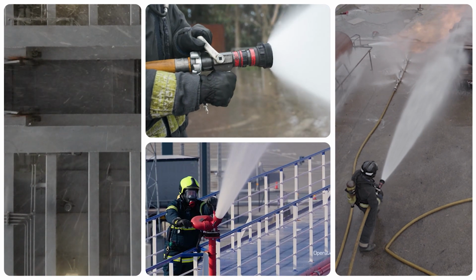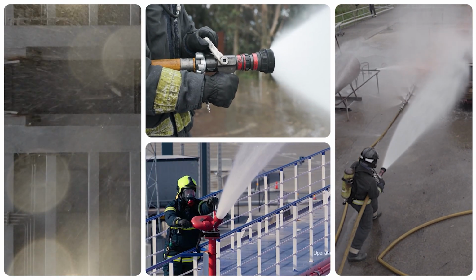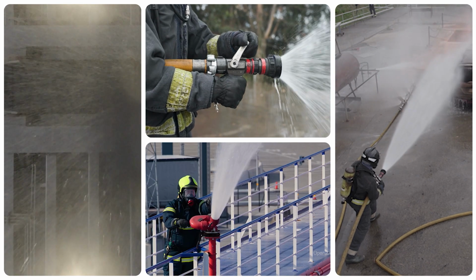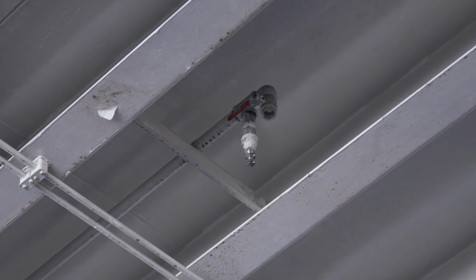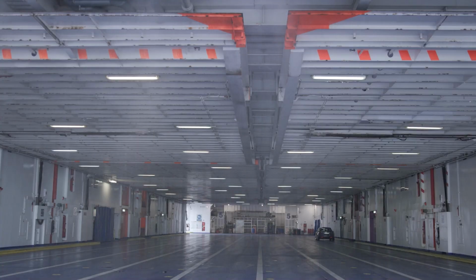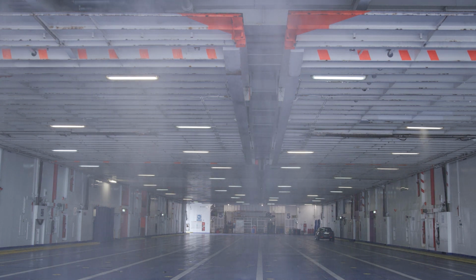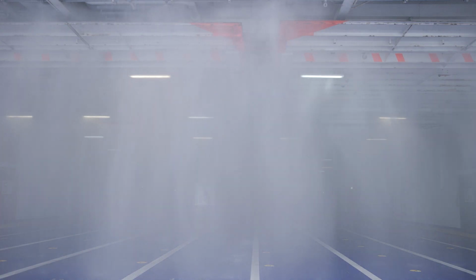Water is an excellent coolant and fire extinguishing agent. This also applies to fires in electric cars. The fixed drencher system is the main tool. It is highly efficient at containing and reducing fire spread in the cargo space and exposes the crew to little or no risk. In most cases, the drencher suppresses a lithium-ion battery fire and prevents it from spreading to adjacent vehicles.